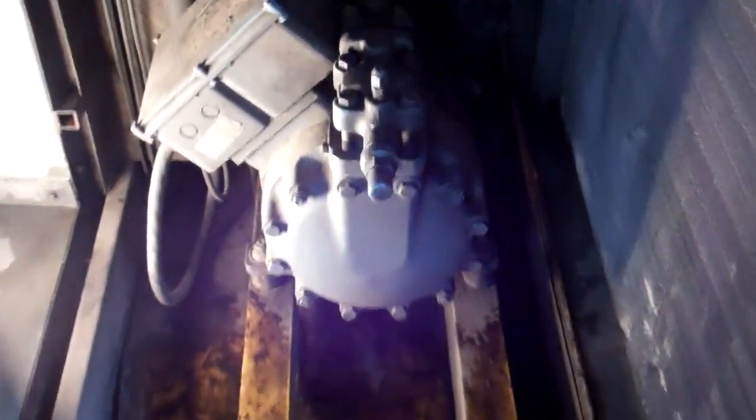You see the colour of the new filter - it's a bit of a change from the other one. I've got some spray grease for those if you want. We've got our new vibration eliminator. We've got some spray grease in there, brazed in there. A bit of a bend on that, brazed in there. The clip was missing here - that might be why it's broken if it's been flapping about. We'll see what we can do with that, might end up tying it on there with something.